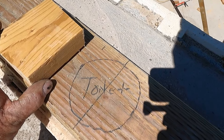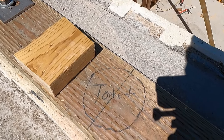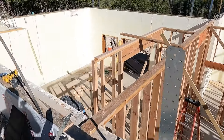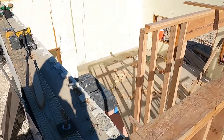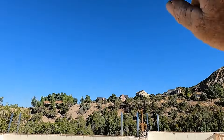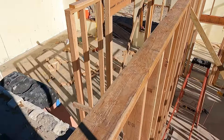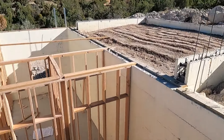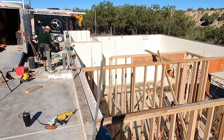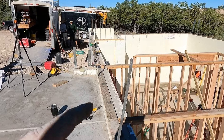Pay attention to your plumbing layout as you're doing your floor — you've got to be thinking down the road. We're getting ready to start floor joists but first we've got to mount these steel plates; they carry all the way to the second floor, all the way up a big steel beam. You want to get all your bolt work and anything that's hard to reach done before you put your trusses on — it'll be a nightmare after.